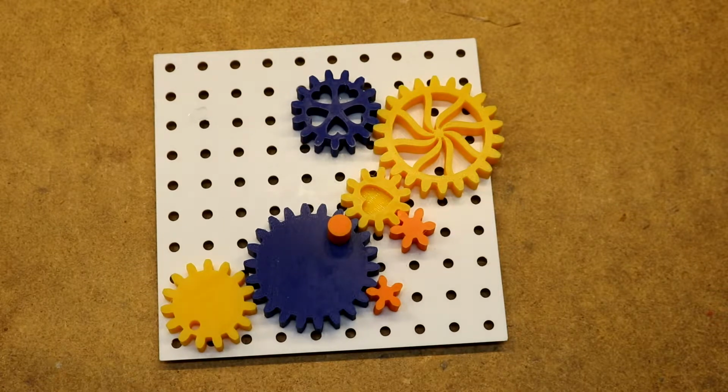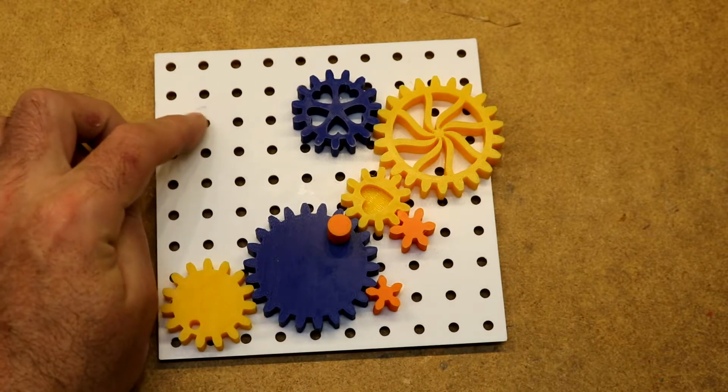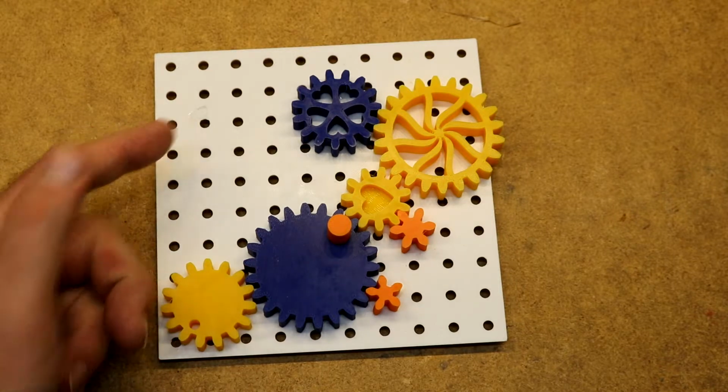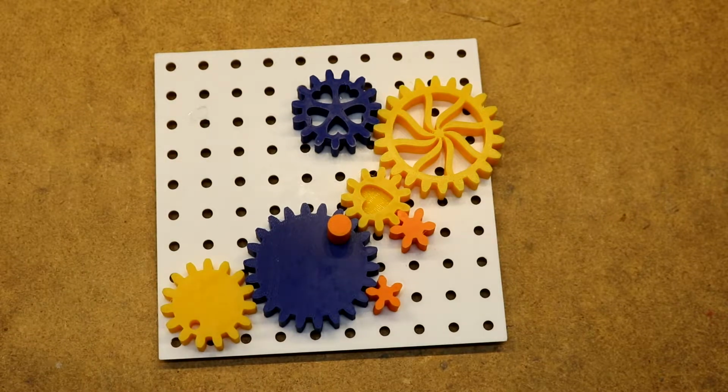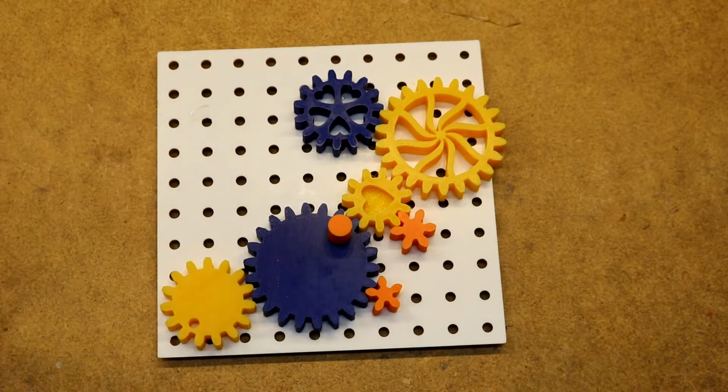I did have one small flaw in my print, and I don't know if you can see it, but it's right here. I lost adhesion in just a little tiny spot. I print my first layer pretty slowly so that I get good adhesion. It took me like an hour to do the first layer, and it happened at the very end. It looked like it was recoverable, so I figured I'm not going to waste an hour and reprint this. I'll just go with it as is, and I think it turned out all right. But make sure your bed is prepped and cleaned well, and if you're using PETG, that you've used whatever release agent you're going to use to make sure you don't have any issues, particularly on something very large and flat like that.